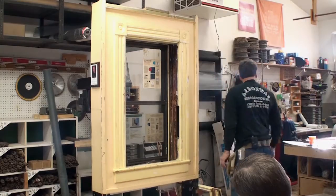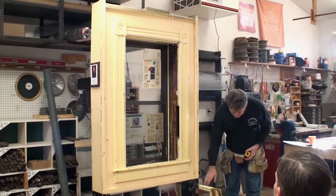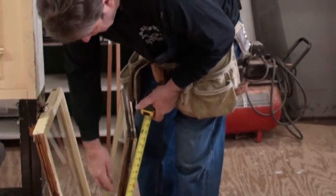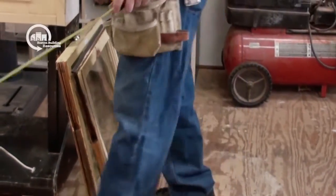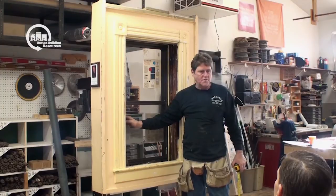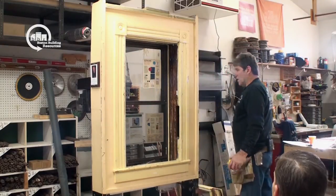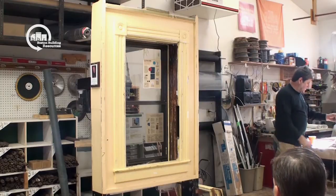The way you measure is just as simple. We're going to chain the top first because that's in the back. All you have to do is measure from the bottom of the sash itself — the top sash from the bottom up to that little hole right there. It's 13 inches. So when I pull the weight all the way up to where it just taps at the top, I want 13 inches of chain hanging there. That way the window will go up and down without bottoming out.